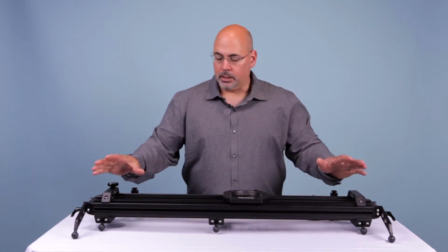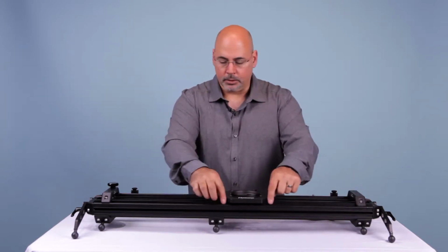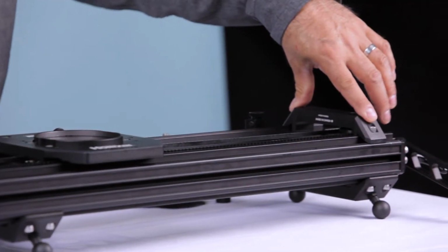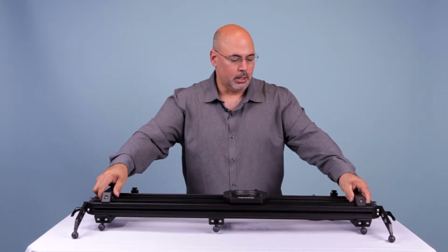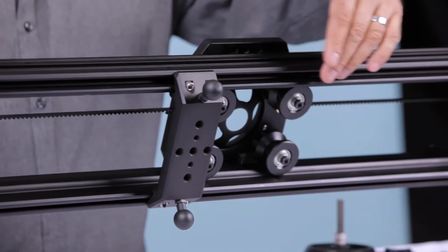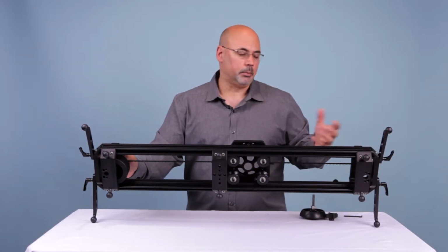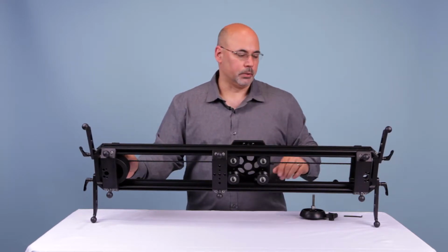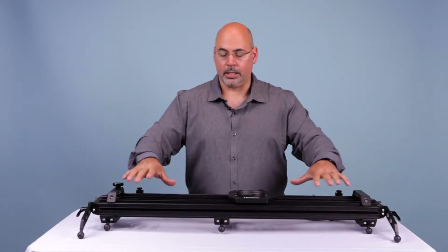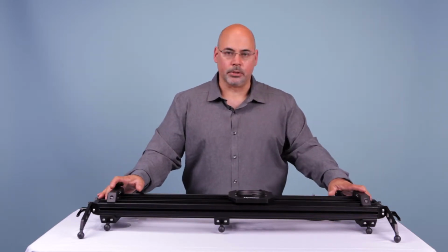One of the nice things about the rail system as well is that we have a track system that's interchangeable. There are actually tracks here in the middle, on the top, and on the bottom. What they allow us to do is put any number of these components on. So if you had a custom request, let's say you wanted more support here, or you wanted multiples of the center mount portion, we can put 4 or 5 of those and they can be slid anywhere. Simply loosened, slid into position, and tightened up. And the unit's self-aligning to within 1/1000th or 2 of an inch just by doing that. You could technically field disassemble this unit and put it back together, and you'd probably be good to go for accuracy. No fancy jigs. It's a self-aligning system. A lot of design. In fact, our patent covers some of those features.